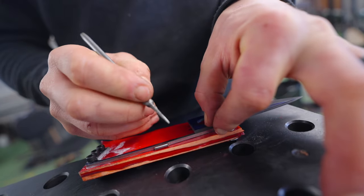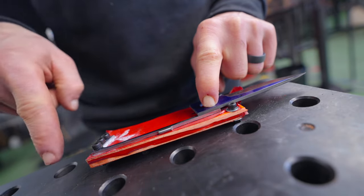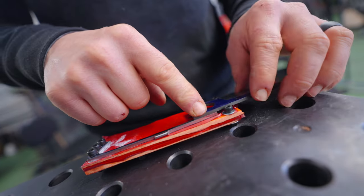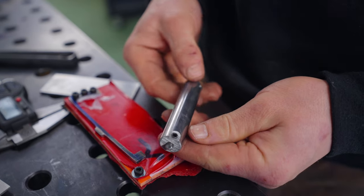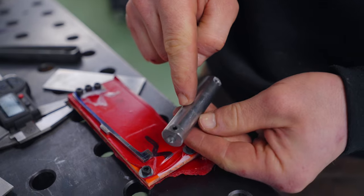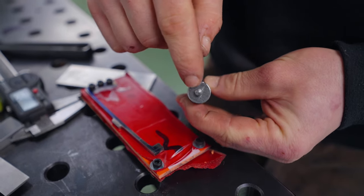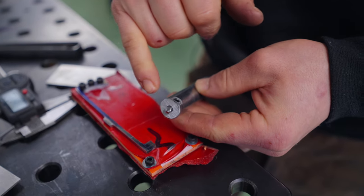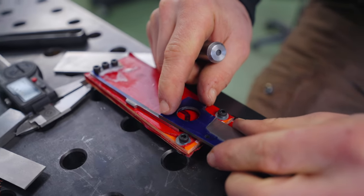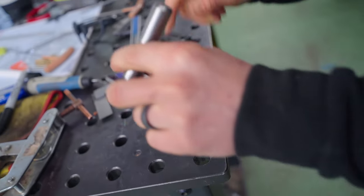With the blade sitting on top, I worked out roughly where the blade should end and that the whole thing has a nice arc across the back. To find the center for the pivot, I rummaged through the workshop and found a 16mm shank arbor I'd made a while ago for a project — it has a little Allen screw and a 5mm hole. I took a bit of 5mm rod, ground a point on it as close to center as I could, so popping that on and eyeballing it should give me exactly where I need the pivot hole.